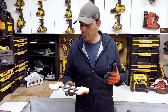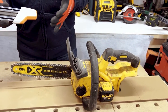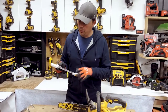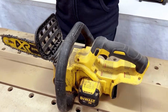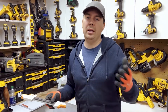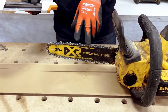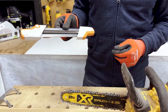For me, being in construction, I do a lot of renovations. I actually use my chainsaw to demo a lot of houses — it's quick and easy. Sometimes I do hit a nail, so when I do that I've got to sharpen my blades. I find it's really easy using this Stihl. These chainsaws — this is the Dewalt 20-volt max chainsaw. It's battery operated, so it allows me to use it inside someone's home without creating a bunch of fumes. On here I've got the Dewalt Oregon 12-inch chain, which I absolutely love. It's actually a Dewalt blade but they're made by Oregon. Pair that with the Stihl sharpener and you're good to go.